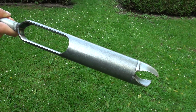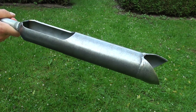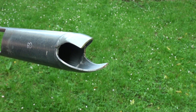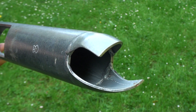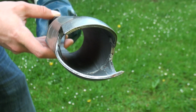The riverside auger consists of an open tube with two spoon-shaped auger blades at the bottom end. The points of the auger blades loosen the soil by scraping it and pushing it evenly into the tube. The auger blades project out a little beyond the tube, which means the auger encounters minimum resistance from the soil.